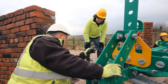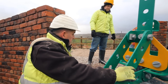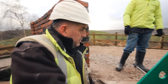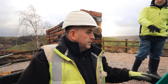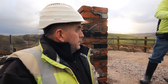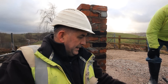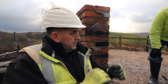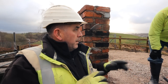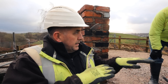We are going to have to knock this over a bit once it's down. I'm going to run through it again before we do. So is the wood coming out when the block goes in? Yeah. The wood's coming out and the blocks are going back in, and you'll just drop them down onto that block and then just take the weight on it. But it's all got to be done at the same time. All four of you have got to work in sync with each other. I want this bridge dropping nice and level.